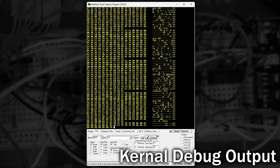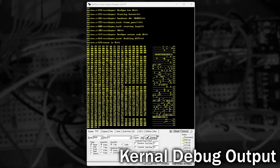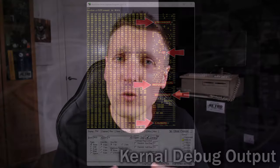I paused the output — this phrase just could not be in the data received over the network. Somehow some of these bytes were wrong. So I decided I'd pre-fill the memory where the packet was going to load into with a known sequence — I wrote the alphabet to it — and tried again. You can see lots of bits of the alphabet still present where there should be real data, but for some reason they haven't been written over. I enabled the BlueSCSI debug options and checked what it was sending, and it was sending the correct information, meaning this must be a strange issue with the SCSI device driver on the Amiga.